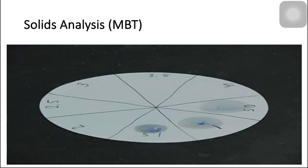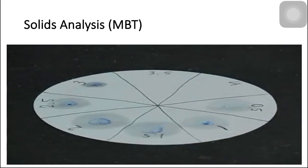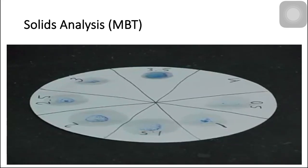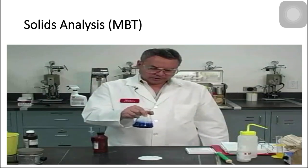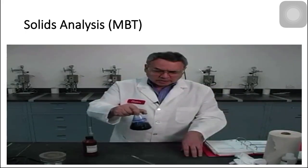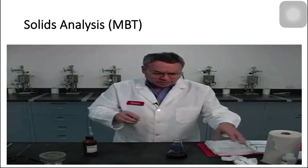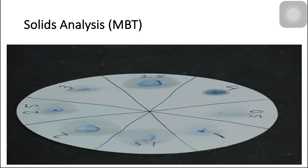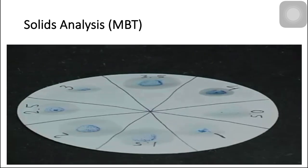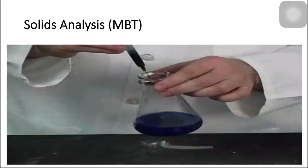So far all these drops gave me a typical bluish color that doesn't tell too much. Eventually a halo will develop which is going to be of a greenish blue tone and very easy to recognize. We can see a trace of a halo — it's starting to show that the reactive clays present in this suspension are already absorbing all the methylene blue they can. So now I'm going to go to the four cc mark with another drop. Not very clear, so we are going to continue — the halo is not there yet. Half a cc more — looks like we are getting close.